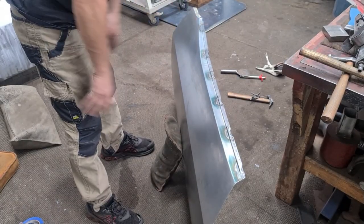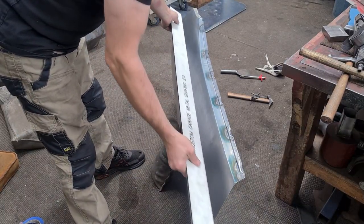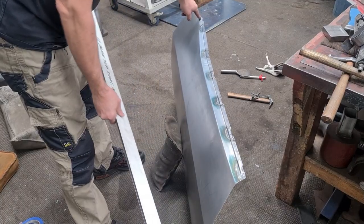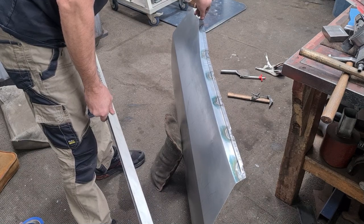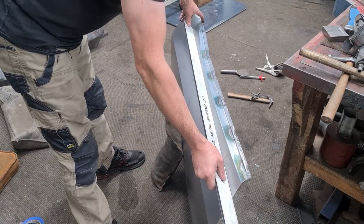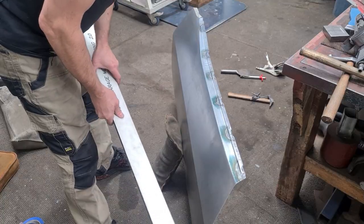That's the top profile kind of roughed in. Just went to check before with the sweep. When you put it across the entire length, there's a little bit of a gap here, but that's because this is locked in on this point here. When this edge goes over, I could even put a shrink on that now. That will puff all that out. You see, it's not really done too much damage. The door looks pretty good. I was worried that the heat from the oxy may have gone a little bit further into the panel than we thought, but it looks good.